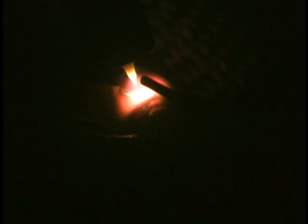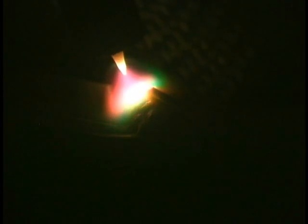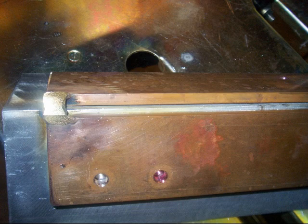I bridged the gap on these two pieces of copper. Yes, it looks rough, but I'm not really worried about that — I just want to get a good hold on it. I didn't have any copper blocks or copper scrap to bridge it with, so I had no choice but to use weld metal. Once I get the gap bridged, I come back with a little reinforcement. You can see the tip of that rod balling up — this is 1/16th aluminum bronze. Whenever you use a rod that's too small with a lot of heat, it's going to ball up like that, especially on aluminum.